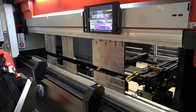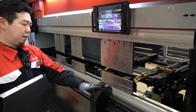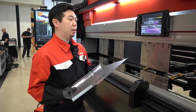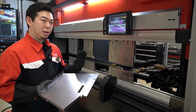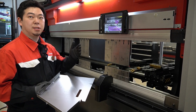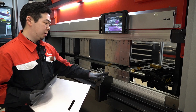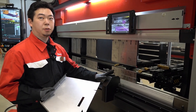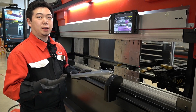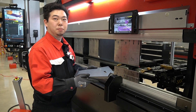Based on that feedback, it's automatically moving the dies up or down depending on what has to happen. While we're bending the part, the machine will bend it to about 92 degrees, put pressure, then release to calculate how much springback the material is experiencing. It calculates the actual springback and gives feedback to the cylinder to make an adjustment, and keeps doing that until it reaches the tolerance of the targeted angle.